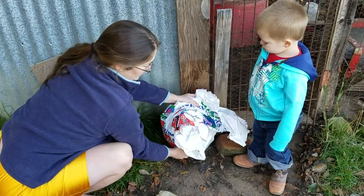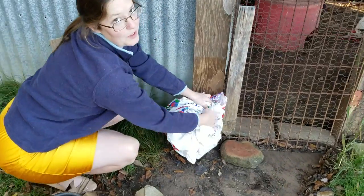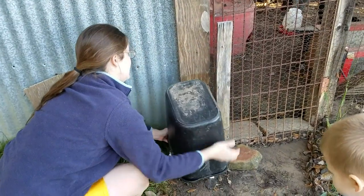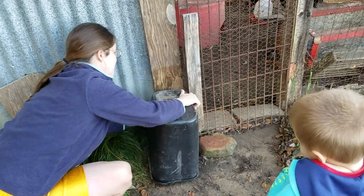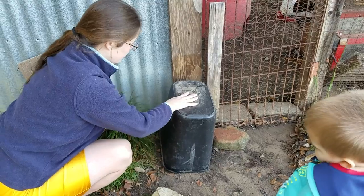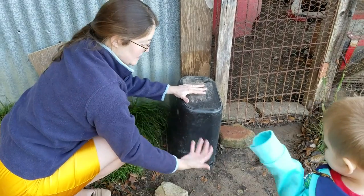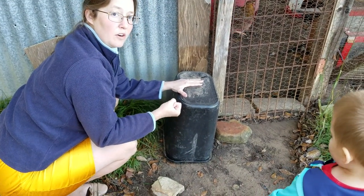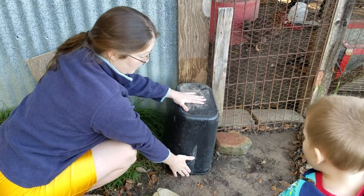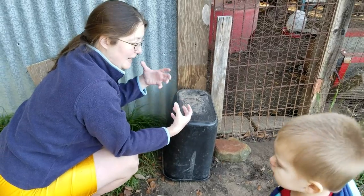You want to make sure it's covering the whole portion of the pipe and the faucet. Then take an old trash can, bucket, or bin that's tall enough to cover the pipe and your faucet — it needs to go all the way to the ground when you invert it over your pipe. If you have extra space, you can grab grocery sacks and stuff them in, preferably things that repel water so it doesn't keep moisture around your pipe.